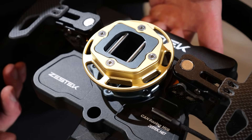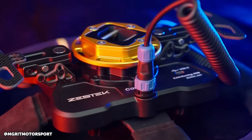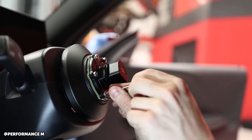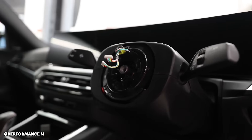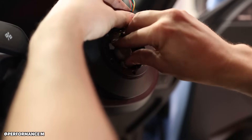For old traditional setups still using air shift — an analog switch — you can just use it too. Complete flexibility to do whatever you want, however you want. On the back of the steering wheel there's also a blue four-pin connector, so if you don't want to wire through the steering wheel hub, you've got options there as well. It's for users with American cars that are still using the old traditional column-mounted quick release, which is a bit different, and they can use that connector instead.